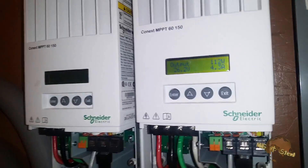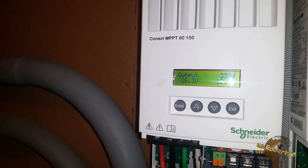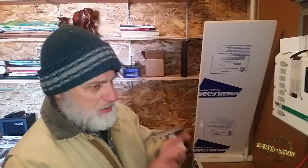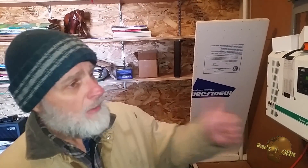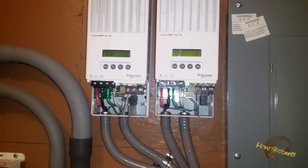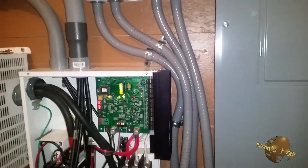So what's the problem you've been having? This one's putting out 4.3 amps and that one's 12.9. When I came out this morning, one was putting out nothing and the other was putting out 1,000. It was odd. I looked at the main south-facing array — the sun is right in the south, so it should be getting the most — and that was the one putting out zero. So I kicked off all the breakers and checked each one: about 74-75 volts off each pair of panels. Once I powered everything back up, that one came on fine and the other dropped out. I don't have the comm cable yet, so that might be the problem, although it seems like it should work just going into one battery set.